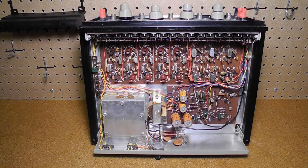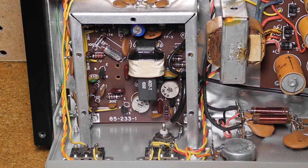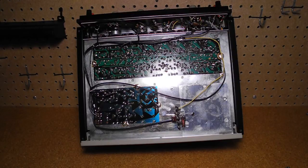The unit was quite a complex kit to build with approximately 65 pages of assembly instructions in the manual. Construction is on three printed circuit boards with additional point-to-point wiring and a significant number of mechanical parts. The unit employs 27 transistors and 8 diodes and does not use any integrated circuits. The large circuit board contains the 15 crystal controlled marker oscillators. Inside a shielded compartment, the heart of the sweep generator is a controllable inductor, an electrical device in which the inductance of several oscillator coils is determined by the current in the control winding. Test and calibration requires a VTVM and oscilloscope but no other instruments, as it uses its own crystal oscillators for frequency calibration. On the underside you can see the bottom of the printed circuit boards and some more point-to-point wiring.